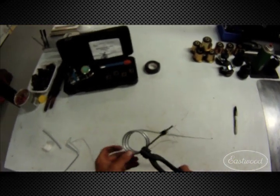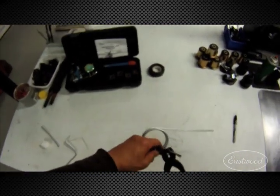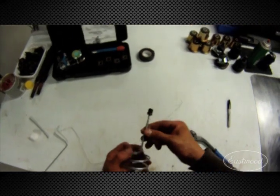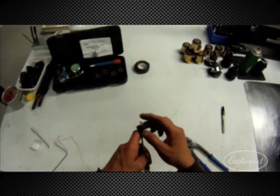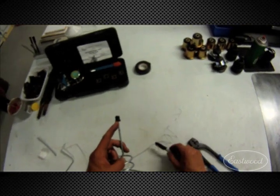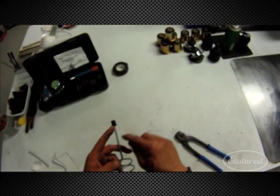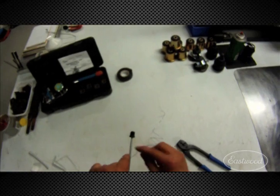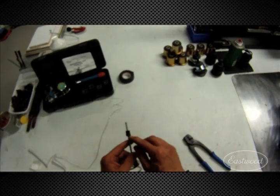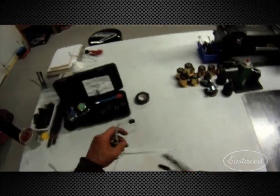We're at our bend radius. Just flip it up — take that up 90 degrees with a nice, clean bend. Here's another tip for how you mark your line: with the Sharpie, you don't go around the whole line — you only mark on the side that you want the 90 to bend toward. Or 45, whatever your angle may be. If you go around the whole thing you're going to get confused and end up with a nice line that fits nothing. So I know here's my mark, I need my 90 to come this way — get your 90.